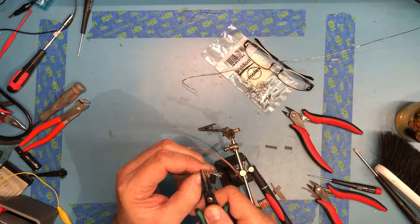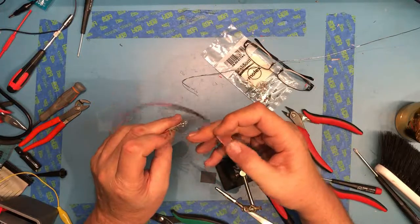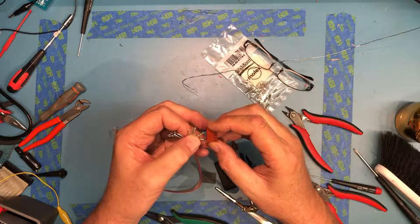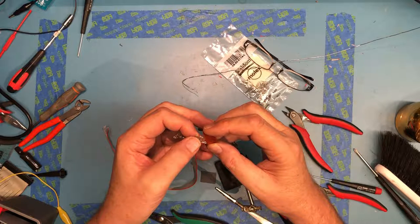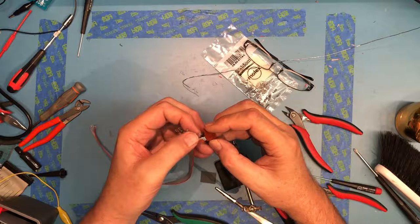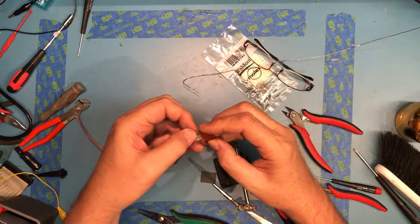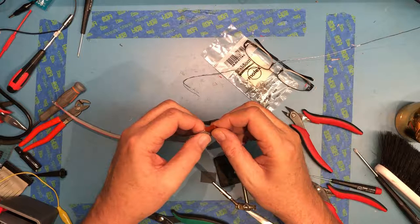We've got one side of a cable here. Now it has to go in this orientation here. The little latch that catches in the slots on this have to be aligned up with the slot. We gotta work all these in. Get them all started before I seat it, because I didn't leave myself a lot of length in the ribbon cable between these. But hopefully I can get those all to seat.